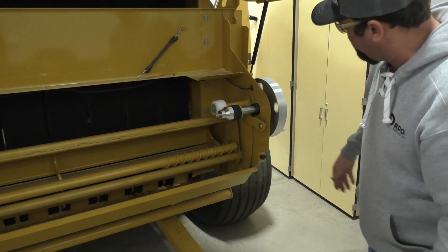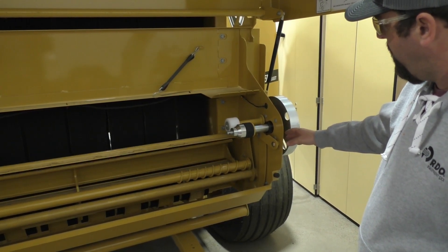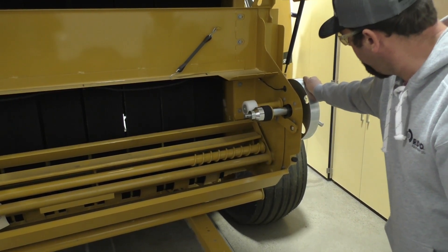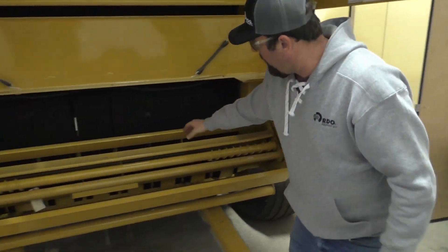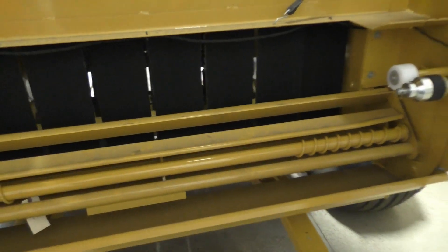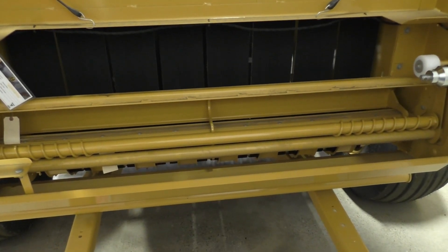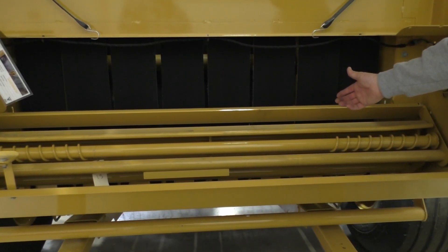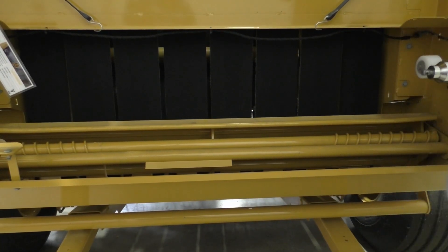Our brake is loose, so we want it to go in there. Now coming back — our brake is applied, so we're now stretching that net wrap tight. We're going over top of the feed pan, and we have our knife ready to go down and cut it. Go ahead and go home — cut. There it applied again, now it's coming back. Clear that code — there it goes to cut. That's basically how that system works.